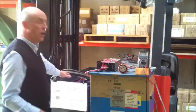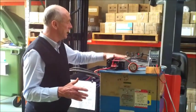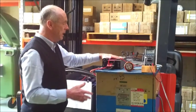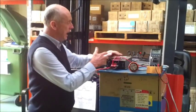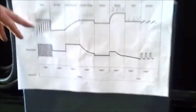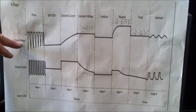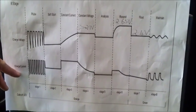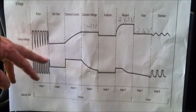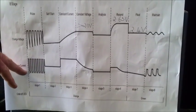So what do you do? Well, what you do is use one of these intelligent 48 volt chargers. It's actually a switched mode 8 stage charger and it works in an 8 stage mode. This is the charging voltage, this is the charging current. In the beginning, we have large voltage pulses which produce large current pulses which stir the battery up and take some of the contaminants off the electrodes of the battery.